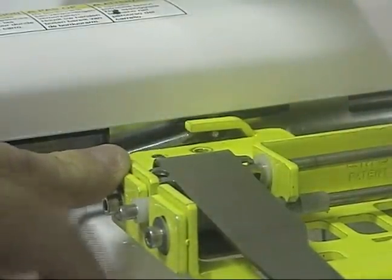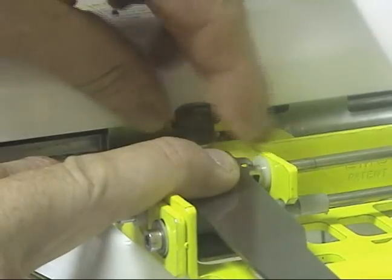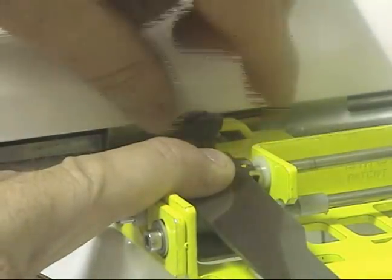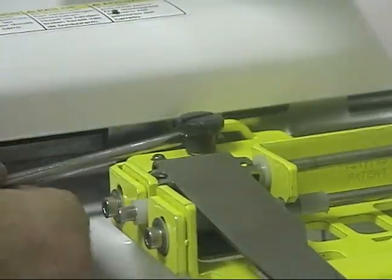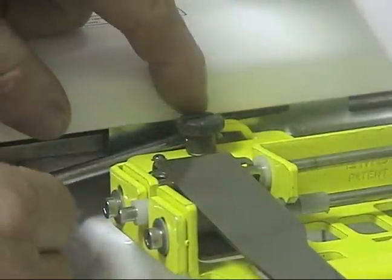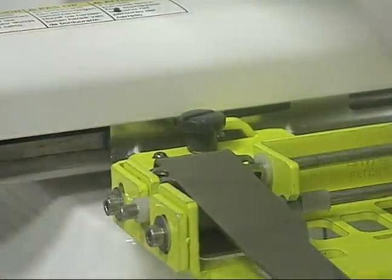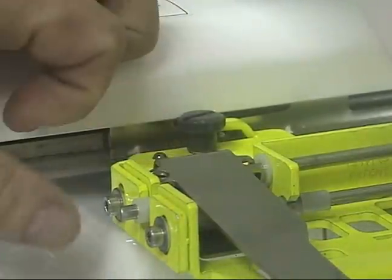What I'm doing is bending up against that little arm. When the screw's in place — and I know the screw's in the way right now — you get the picture. I'm pushing up on that arm; you can see how it's flexing up, it'll bend up slightly. And that's what we need in order to change the setting on this arm to calibrate this clamp.